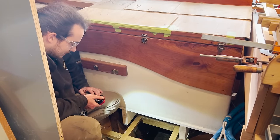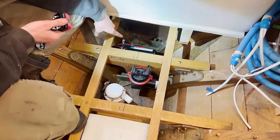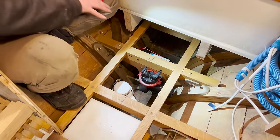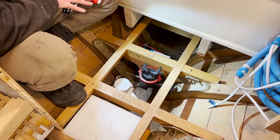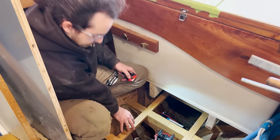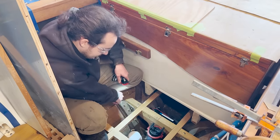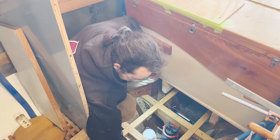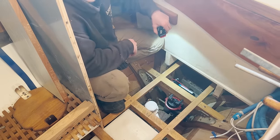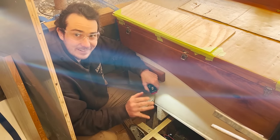So here we've got three pumps. This is a bilge pump, this is a gray water pump, and then this is a freshwater pump. And then this bilge pump obviously pumps out the bilge. And by putting them kind of in the same place, we make it a little harder to run the piping, but it's easy to access all of them through the same hole in the floor plate. And the bilge pump is in a really nice spot. In case it gets clogged, you can clear that out pretty easily. This gray water pump is used to pump the gray water tank overboard. And then the freshwater pump, this is the luxury one. So Steve wants hot showers, which I understand the reasons behind. And we're going to great, great expense to make that happen.